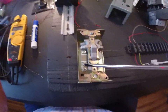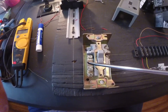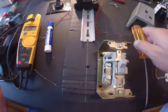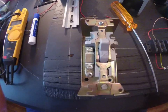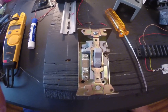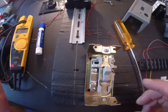So obviously what this would do is if the motor was to overload, it would melt just like the other one, and it would disconnect one of the hot legs from the circuit and then the motor would become an open circuit. This would be a 220-volt type of setup with two hots, and the circuit won't work if you open up one of the conductors. There's no path home.